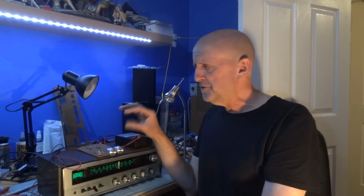First of all, I've got 3 soldering irons now. I had a 100-watt soldering iron and a 30-watt soldering iron, which seemed to do me for every job I wanted, to be honest with you, until I started mucking about with these receivers. These tracks are a little bit thicker, the solder's a little bit thicker, and it's old solder as well, and it sometimes takes a bit of going to get it melted. A 30-watt iron wasn't really ideal for that.